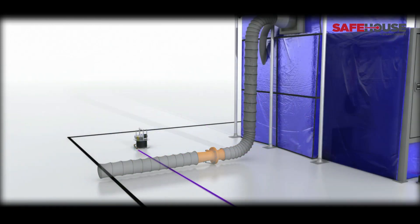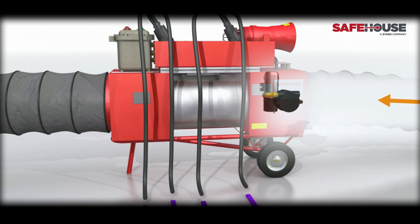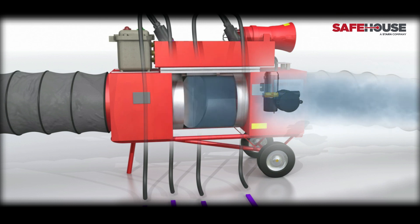A comfortable environment is created within Safehouse Habitats by the utilisation of the local extraction system. This manages fumes, smoke and maintains the correct pressure. Safehouse Habitats' supply of fresh air is monitored by the gas sensing module. Harmful gases and hydrocarbons are prevented from entering Safehouse Habitats as the damper automatically closes when the sensors detect methane or hydrogen sulphide.